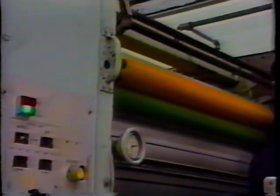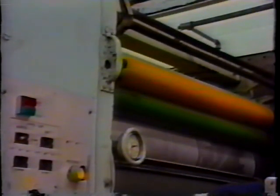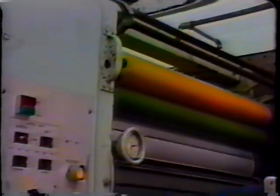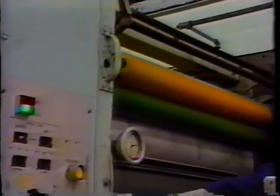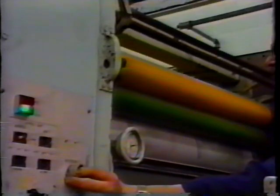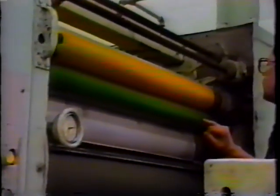We'll go to our roller setting and make it slightly tighter. Inch the press again, get rid of the old stripe and distribute the ink again. Stop the press. Reverse in this case. And look for our stripe again. This side, I would say, is about 1/4 of an inch. And if we go along to the other side, we'll see we're slightly lighter here. We can tighten that setting just a little bit more.